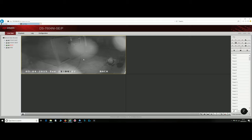Again, I'll unplug it and I'll plug it in. Now it's better where it comes up the drive. I've diverted it in that direction on purpose, trying to get the best image if somebody was coming up the drive. It is very hard because the grass, as you'll probably know, is quite reflective of infrared light, so you get a blowout there. But don't forget, the dome is still covered in water. I've just splashed it, and this is how it is now with the separate infrared emitter, which is quite a way along the wall, now on.